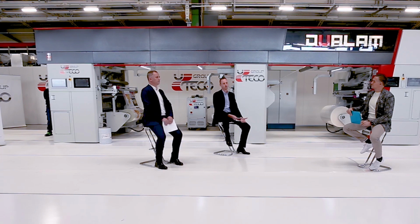The DuaLam adhesives have special characteristics, such as, for example, low viscosity of the two components, especially as far as the second component is concerned, which can be applied, as Alessandro said, on the semi-flexo group; a high speed to develop the mechanical properties of the adhesives, which allows for a much faster time to market; a fast decay of the primary aromatic amines to guarantee the safety of the final consumer; and a fast development of the cohesion of the adhesive after lamination, which allows us to avoid those irksome problems which are typical for solvents, for example, telescoping or tunneling phenomena; and above all, a high wettability of the product, quite beyond the speed of the machine, which can be compared to the solvent-based adhesive, especially with a low grammage.